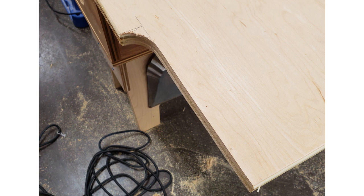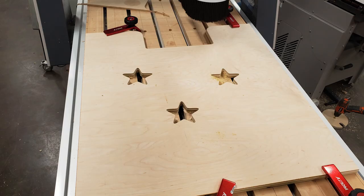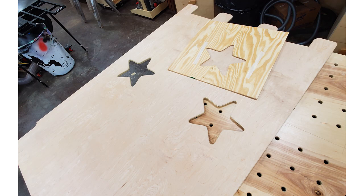The left edge of the tall plywood side will be against the wall, so a notch is needed for the baseboard so the plywood can fit around it. This notch is much larger than the baseboard, but a scribed fit isn't necessary in this case — it just needs to fit in place and doesn't have to be perfect. This isn't a built-in piece of furniture; it's just a cool fort that my daughter is eventually going to outgrow and will be removed. My plan was to have a rectangular window in the large wall, but I decided to go with a star theme for a more interactive design. On the short upper wall I used my CNC machine to cut three randomly placed stars, and for the large wall I used the CNC to cut a template to once again use a router to transfer the cut to the plywood.